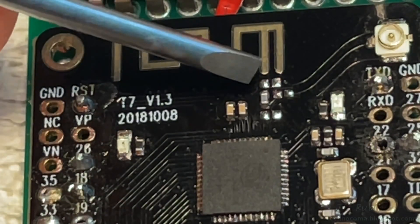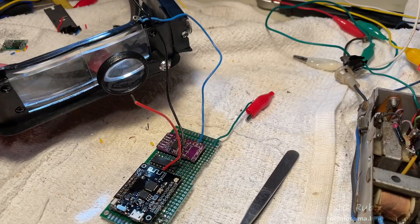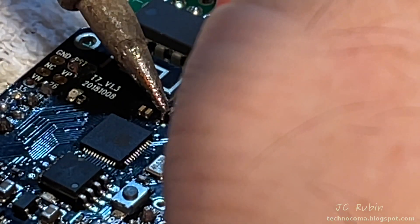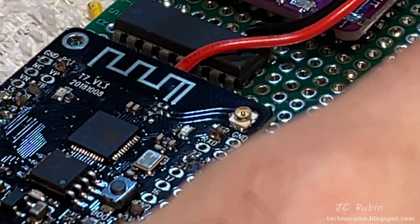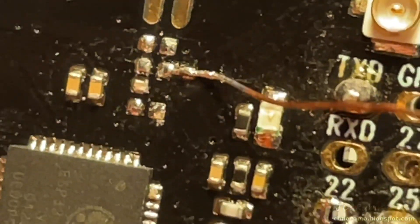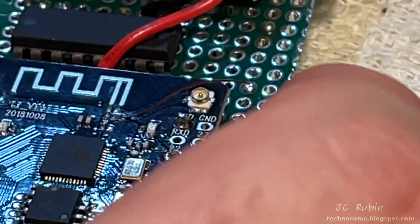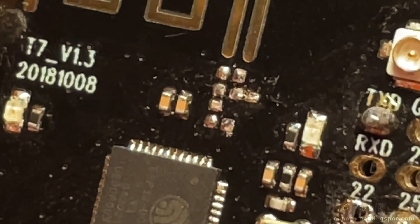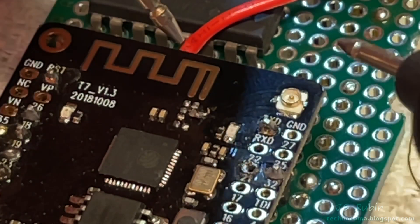The next part involves some microscopic surgery to move a resistor, switching from the internal antenna over to the SMA connector. I use a special iron for really small projects — I never normally do anything this small — along with tiny tweezers. The resistor came off with no problem, but then it flew everywhere. I managed to get it over there and then it was gone forever. It's just a zero-ohm resistor — I don't really need it. Instead I got a thin-as-a-hair copper wire that I soldered across both leads. Now I'm testing it: good reading across both leads, snip that tiny end, and we're done.